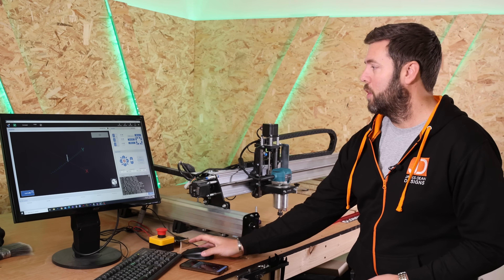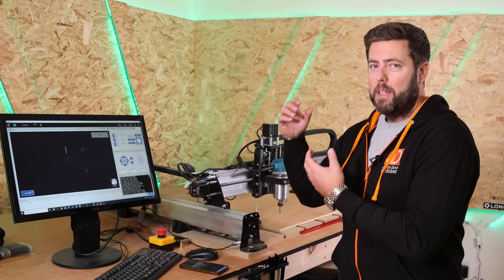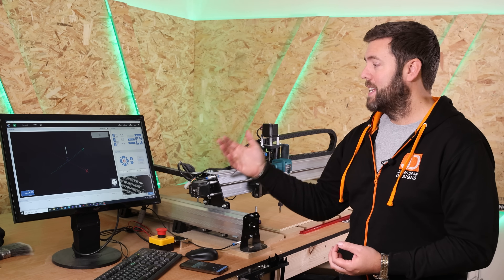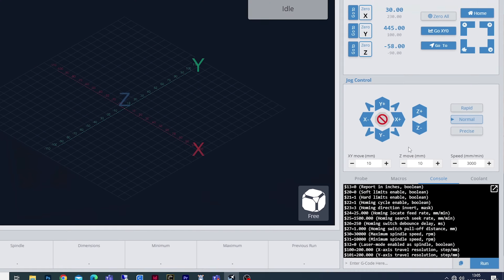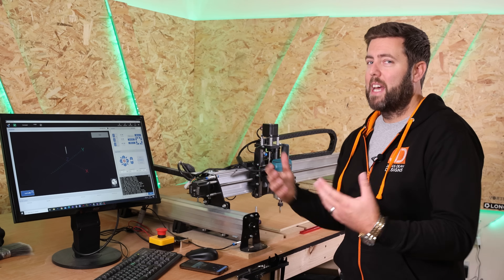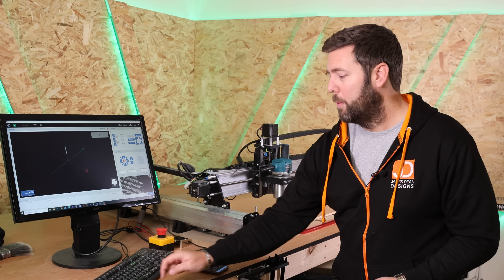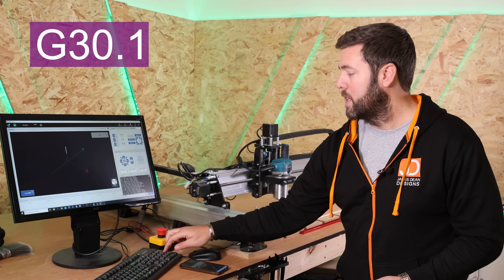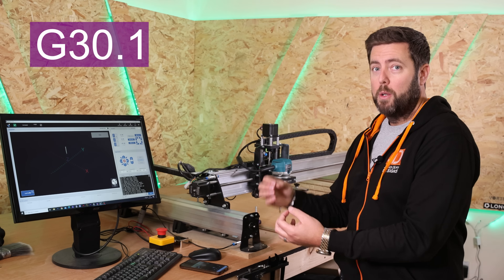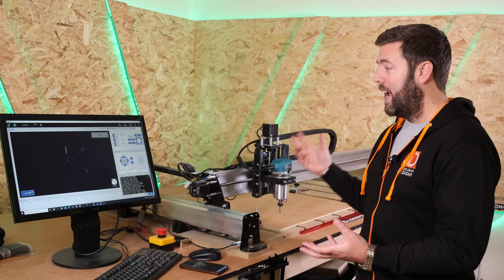For safety I'm going to raise this up a little bit. Now, in your control software you should have somewhere that says Console, which is an area where you can type information into. In G-Sender it's on one of the tabs in the bottom right — usually in a similar place on Candle, UGS, that type of thing. What we're going to do is click into that area and type G30.1. G30 is the memory slot; the .1 is telling it to remember where it is now. We hit Enter and it will save that particular position in its memory.